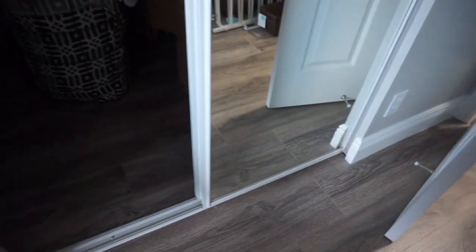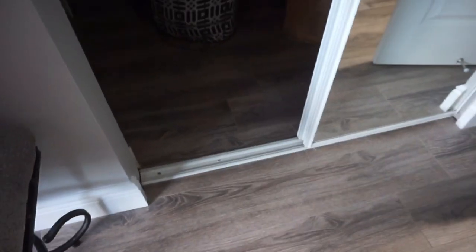The laminate then goes into the master suite. The closet doors were removed, the laminate went under them, and then the track was reinstalled and the doors were replaced. On top of the floor we use short screws that just go into the laminate and not the actual subfloor so that the floor can expand and move around the way it's supposed to — we don't want to pin laminate down by gluing or screwing. Coming into the master bath, they had marble already in place, so we used our slim and sleek cool modern molding that is minimal and accents the end of the floor without creating a tripping hazard or a gaudy molding. I hate thresholds — just say no to thresholds is my campaign.